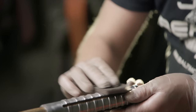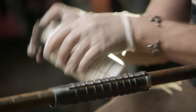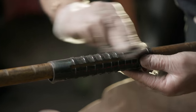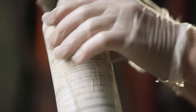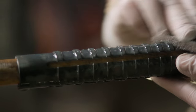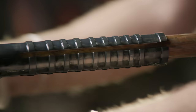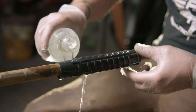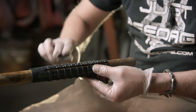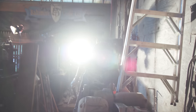So this is pretty similar stuff to the black oxide compound you see us use in the past. EPA decided that you really shouldn't have that, so one more coat. The nice advantage of doing this over painting is that it won't rub off. It's a chemical reaction. All right, let's wash it with water. Use an abrasive and just kind of skate the surface and highlight it. All right, from here, we're gonna move to the Scotch-Brite wheel outside for our final finish.